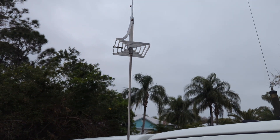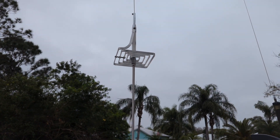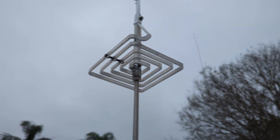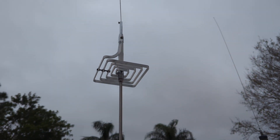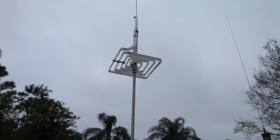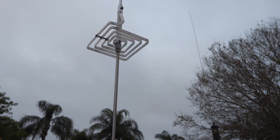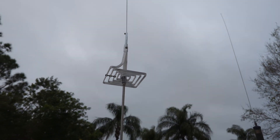Dr. Jack makes a 10 meter version — this one here is called the Perfect CB, and he also has the Perfect 10, which is tuned a little differently for 10 meters. Your results may vary; you may need to loosen the little 8mm nuts and trim a bit. Using an analyzer like I showed you will tell you a lot about what your antenna is doing.